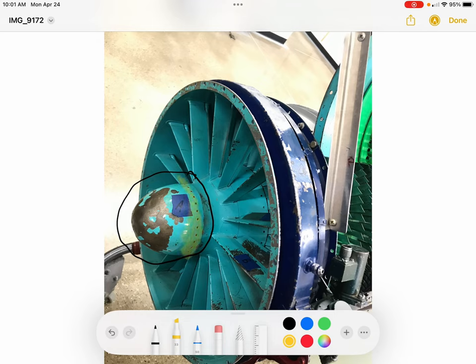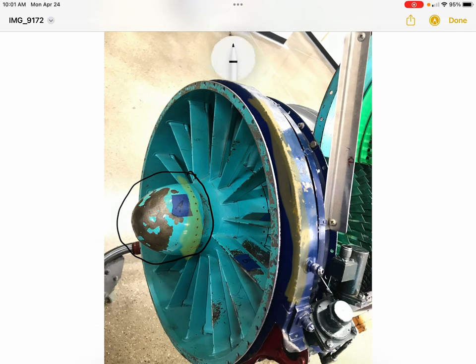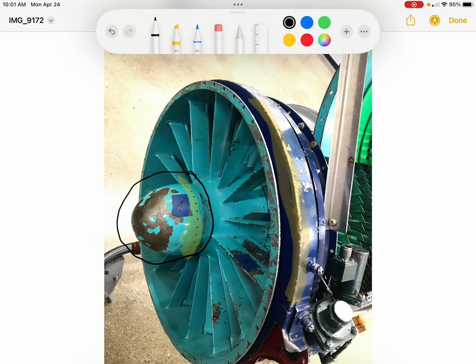And a little bit later, we'll talk about anti-ice, but this engine is anti-iced using this ring. Air travels through this ring around the outside, entering the ring through the valve at the bottom, which is covered, but right here, the anti-ice valve is down here in the lower right corner. That allows bleed air or warm air from the compressor into this ring, and then it travels through the ring and then through the inlet guide vanes labeled B right here. And it warms those up, and then the air has to go somewhere, so then it comes out the holes and gets pulled into the engine.